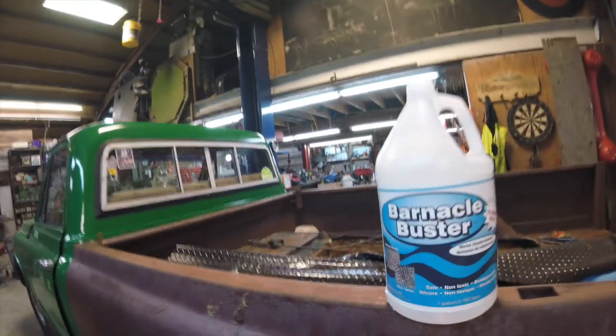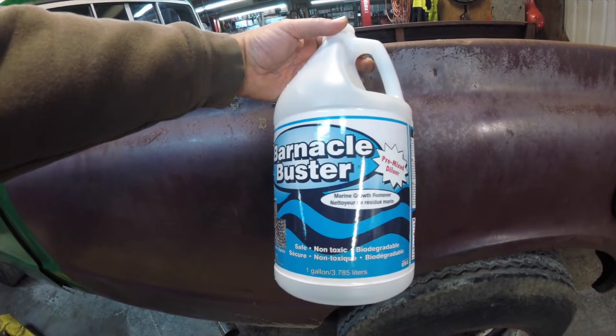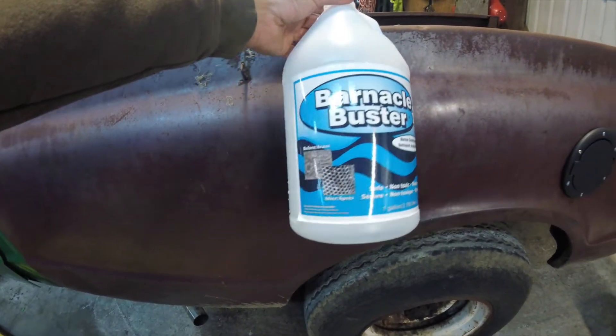If you're having problems with your boat overheating and you've checked your sea strainer and that seems to be fine, but if you run your boat for a while and it starts heating up or getting hot, here's what you may want to do. You want to use Barnacle Buster. So here it is — Barnacle Buster, marine growth remover. It's pre-mixed, non-toxic, biodegradable, and safe. There are a couple of before and after shots. You want to run Barnacle Buster through your raw water cooling system. This will help remove growth, calcium, and buildup inside.